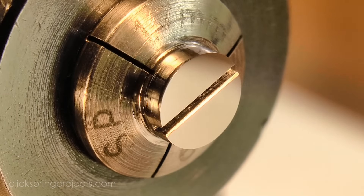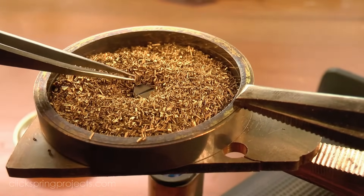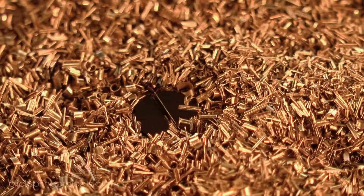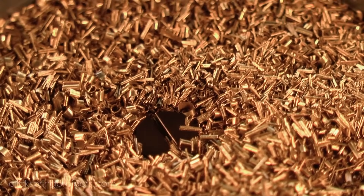So with all of the surfaces polished, the final step is to give the screw a nice blued appearance. As before, I'm using a butane torch and brass shavings, but this time I'm being a lot more careful about how the color turns out. The screw surface is as clean as I can get it, and I'm keeping an eye out for any parts that change color too rapidly.